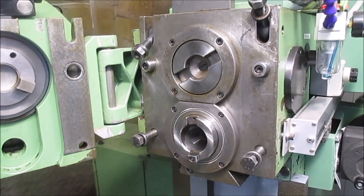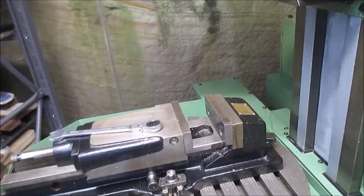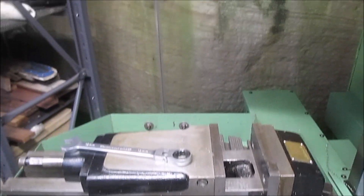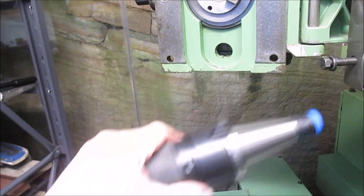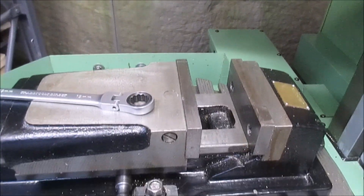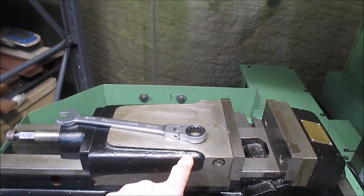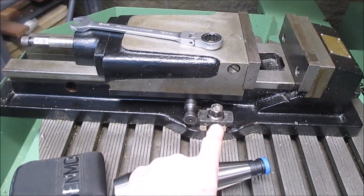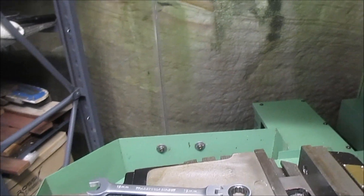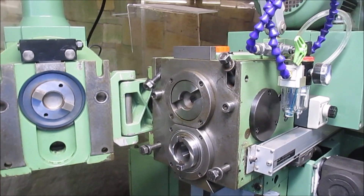The problem with that is when you look at how much the tool sticks out — looking at the rotary table with the cutter stuck out like that — there's not a great deal of range to the center line of the rotary table. So it's not that useful being able to machine in that position from that axis.